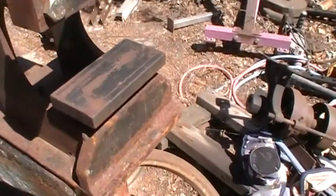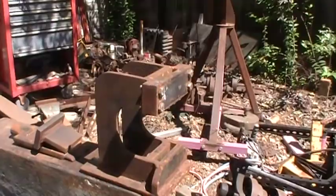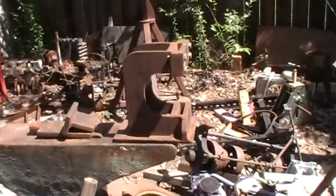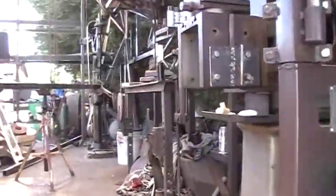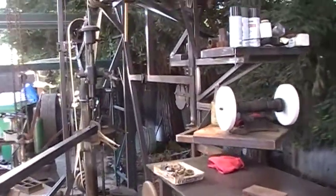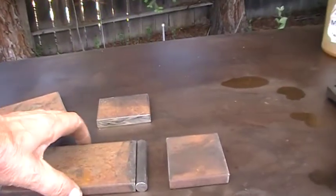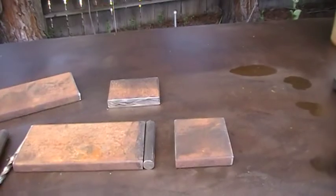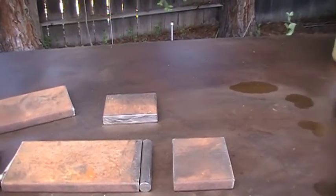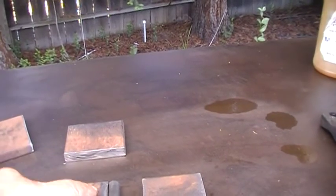I had some fullering dies. And you might have noticed I'm not really organized out here — I'm trying to get organized. This trailer is a tour de force in organization. I'm going to get organized, and that's why I built all my shelves. So what I built — I'm having to make another set of fullering dies. In this case I've got my half-inch by three-inch flat bar, and this is just half-inch round bar, which I'm going to full weld it — I'm going to TIG weld it, because this has to fit inside the Smith's Magician. But this will be fully welded.